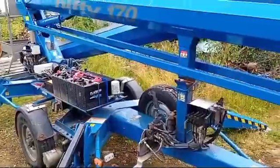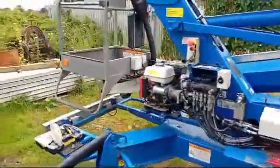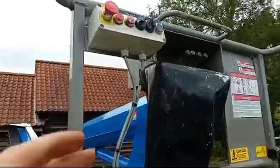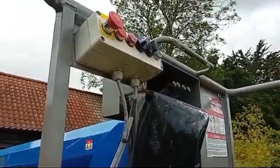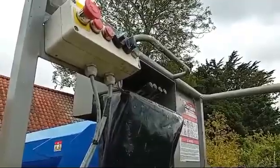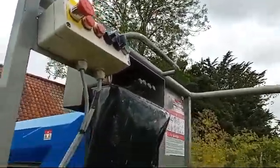We'll go through the straightforward reasons why that won't work, starting with the simple ones. When you've got out of the basket and finished your job, you may have knocked the stop button in — it really is as simple as that. It's at hip height, it's a bit too easy to get to. Nearly all the time the machine won't work just because you knocked the stop button. That goes clockwise, an eighth of a turn, and that comes out. So that's ruled that out.